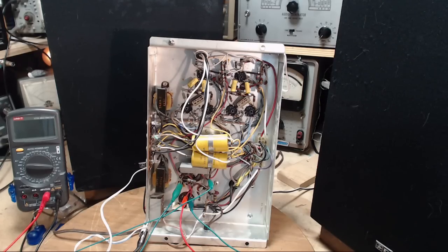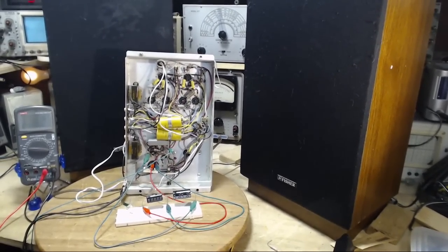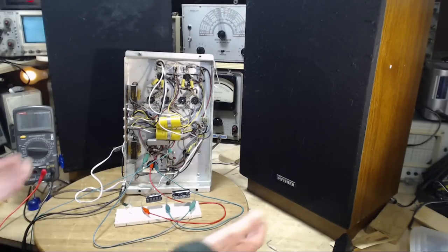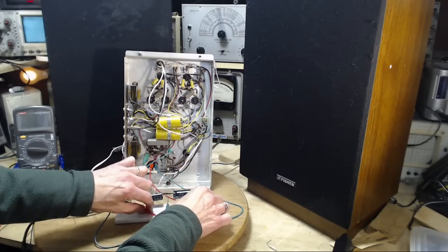So, sound memory is terrible. I was told once your sound memory is good for about 7 seconds. And then you really can't do anything with your memory of a sound after that. Okay, so I'm going to remove the capacitors now and see if the hum level goes up. These are charged up to a high voltage here. I don't want to do something dumb. Here we go.